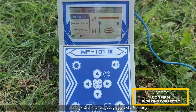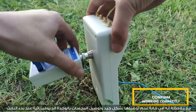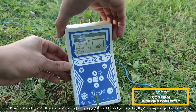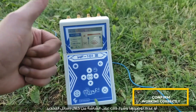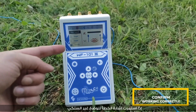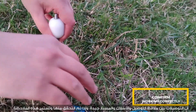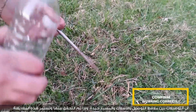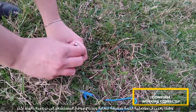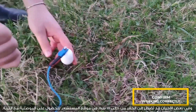Make sure the wires and probes are connected well. The geophysical system provides a smart system for verifying electrode conductivity in the soil and displays warning messages on screen. If an error signal persists, check the wire connections and probes. If the error continues, the soil conductivity is weak — moisten the sensor site with water or drill 10–15 cm beside the sensor site to improve soil conductivity.